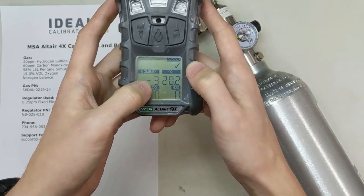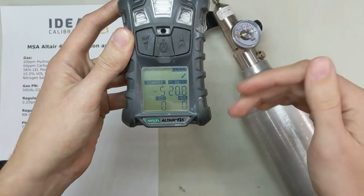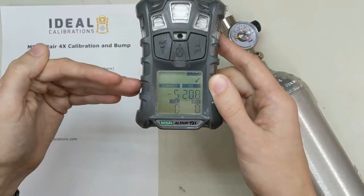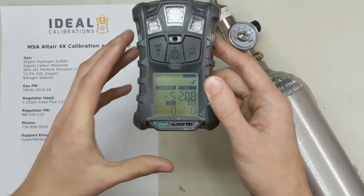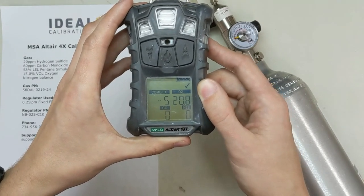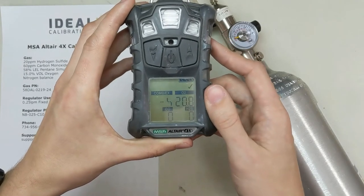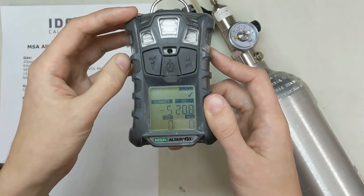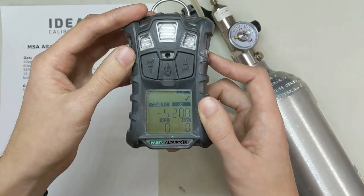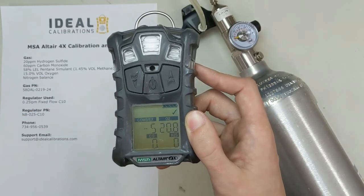See this one — it's gone negative. What's happened here is it's probably had some sort of inhibitor on the sensor, and when we ran the calibration gas over it, it's clearing that out. So now it's actually changed how it reads — before it was reading a little bit higher, but it's cleaned some of that stuff off, so now it's reading negative back on the zero side. In an event like this, I'm going to recalibrate this unit. Keep in mind this doesn't mean anything is broken. It's just something that happens when crust builds up inside that LEL sensor, and when you calibrate it, it goes through this process. We see this pretty commonly in the shop — just remember you've got to calibrate it one more time.